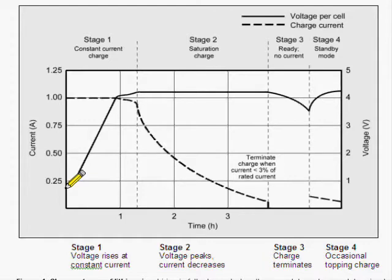Then what we do is charge at about 0.8C — most 18650 manufacturer specs call for 0.8C in the constant current stage. We do that until we reach about 4.0 to 4.1 volts, then we switch over to a constant voltage charge at 4.2 volts. There's a tolerance involved, which is why I say 4.1V — you don't want to go over 4.2V. If you exceed 4.2V you start damaging the battery, and worst case the thing goes ballistic, explodes, and you've got a smoking pile of plastic and goo and a fire on your desk.